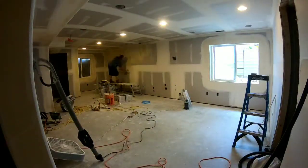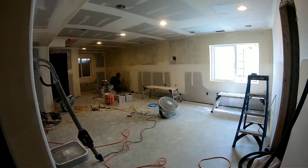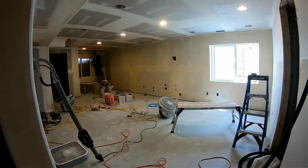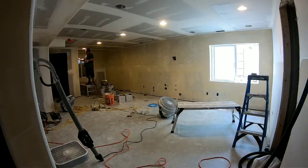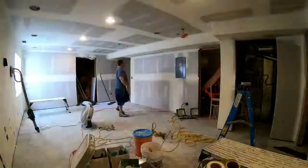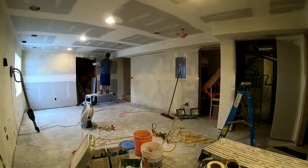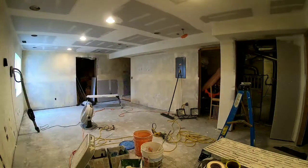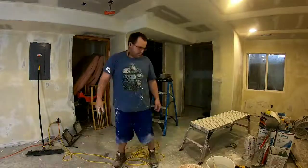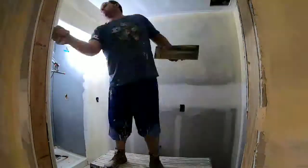Moving right into Holy Smooth texture — this is my favorite texture. Really cool to watch put on and it's pretty easy. You just kind of smear it on there and wipe it off real tight and you get that look. One of my favorite things about Holy Smooth is I don't need to pre-sand the walls with this texture because it hides everything. We'll sand once it's dry and that'll smooth anything out.